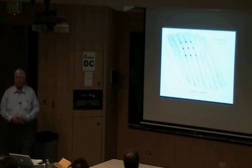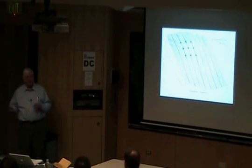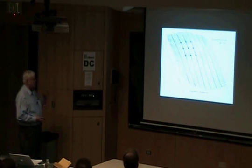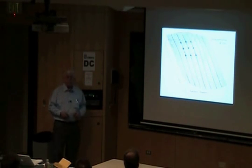Now I might comment that in making these, you had to somehow have a way to tolerance it and to measure it and know whether it was good enough, whether you could stop leaning on the opticians to make it better, whether you were already there, and after you mold parts to know whether the parts were good. And since this was an eye lens, I used ophthalmic tolerances. What we have here is 7 profilometry passes across that piece.